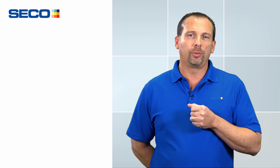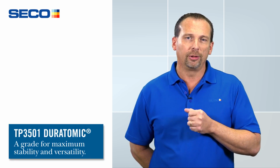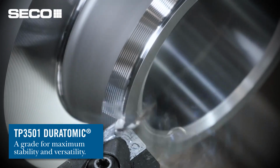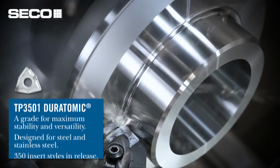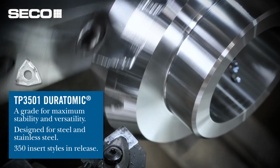One of the third major things we have coming for this launch is an upgrade to TP3500 Duratomic turning inserts. Those inserts are going to go chrome and be upgraded to TP3501. TP3501 will incorporate the chrome used edge detection of what you've seen with the 0501, 1501, and 2501, and well suited into those applications that are much more demanding with interrupted cuts.